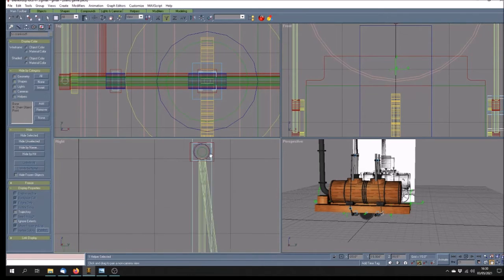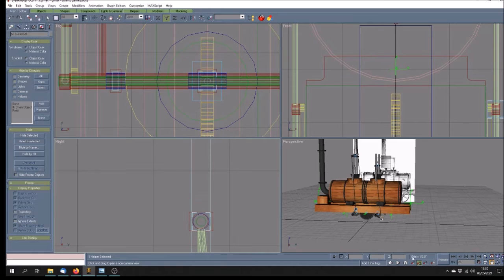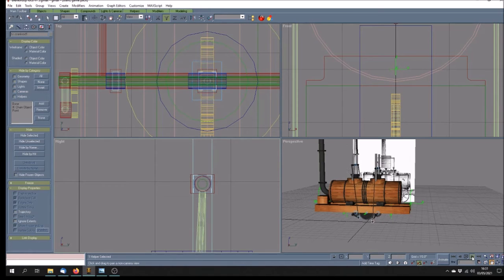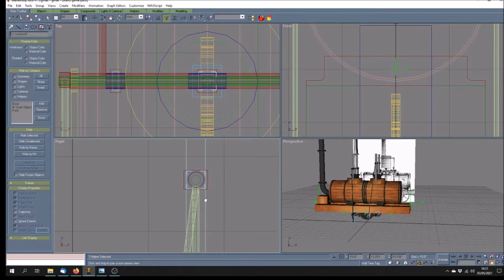So if I step it through in the wireframe, you'll see that the top end of that cylinder, not this other vertical one here, the vertical one is the piston rod, actually it goes into the piston. The driving rod here, although it swings about, you can see it swinging backwards and forwards like that as the crank turns, I made sure that its end always coincided with the correct position on that vertical there.